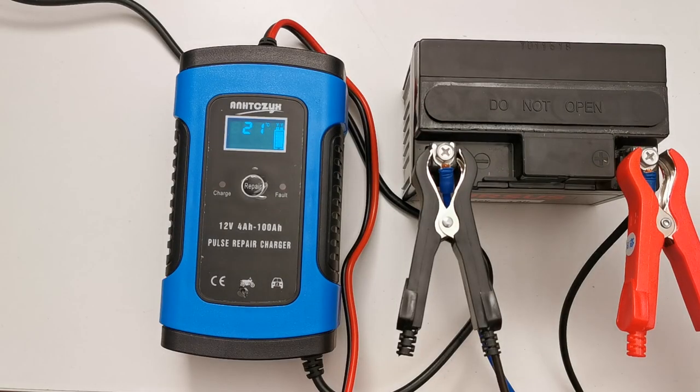So if the battery has been drained quite a lot, the charger will use more current to charge the battery faster, and then will slightly reduce the current until the end of the charging to get the best charging result and to prevent the battery from getting damaged.